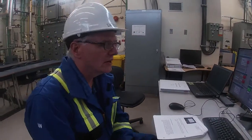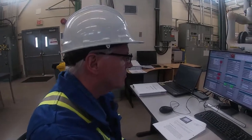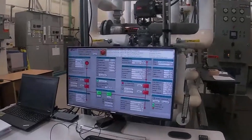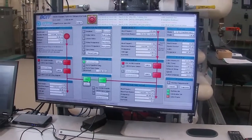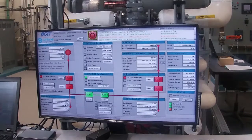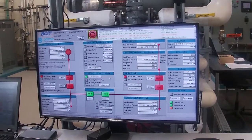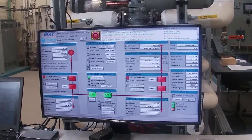Okay, fellas, so in order for us to synchronize onto the grid, we have to go through our tiebreakers. There's a couple things that need to happen. First of all, I need to close CB2, which is on our switch here. Once that's done, then I need to do a synchronization. And I'm not going to do a manual sync, but we will sync in auto.